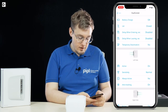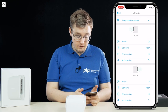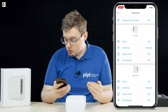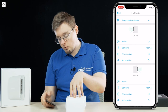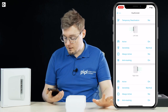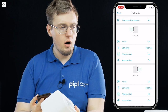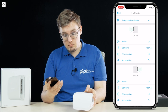Here you can see the status. You can turn on and turn off the active left and right sides, and adjust the sensitivity. Set it to always active — 24 hours — because right now it's active only when the system is armed, so it does nothing when disarmed. Anti-masking is on by default; it could be turned off, but turn it on because it's always better.